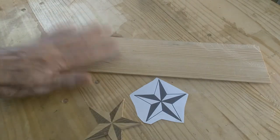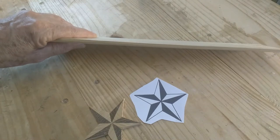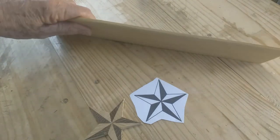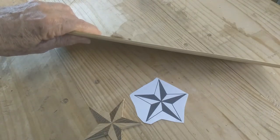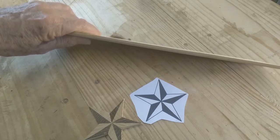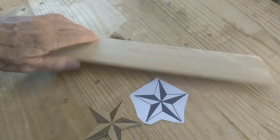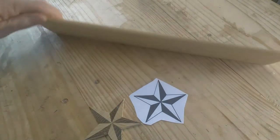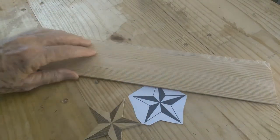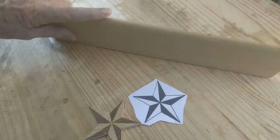What I used was this board right here. I made a rocking chair and the rocker and the part of the legs had to be a specific thickness, but it was thinner than stock wood and I didn't have a planer to plane it down to the proper thickness. So I re-sawed it with a hand saw and planed it down by hand. This is what I sawed off — planed fairly smooth with my hand plane, about a quarter inch thick, with a rounded edge.